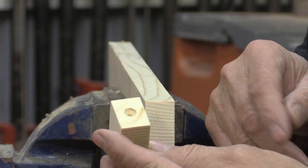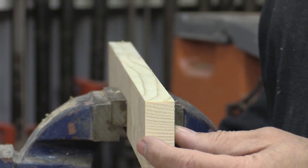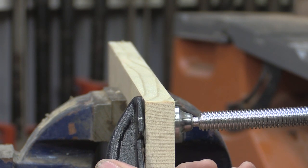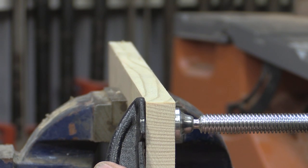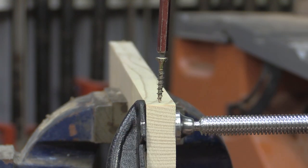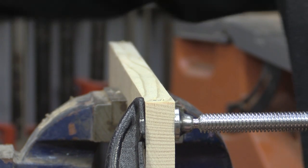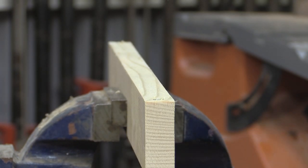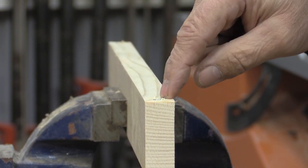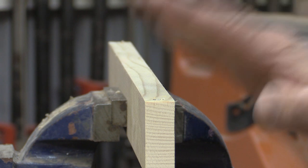Now I'm going to show you a little trick. Here's the end — I just cut this off. This is the pine. Remember how easy this one split? The trick is clamping. If you don't have a countersink handy, if you clamp it — watch this — remember we're not countersunk here. Now watch when we take the clamp off. It stays! That's because we've compressed the wood.